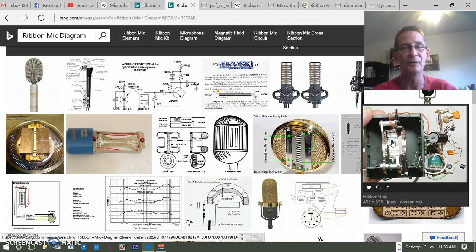Nowadays manufacturers are working on better materials, but when dealing with strong percussive sources, it's best to angle the microphone, because the more it's angled, the less direct impact on the ribbon. Having the ribbon laid flat relative to an incoming impact means the top can absorb impact without hurting the ribbon. Use different angles so there's no direct impact on the ribbon — this is crucial, because plosives from your voice or percussion instruments can really damage the microphone.